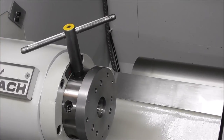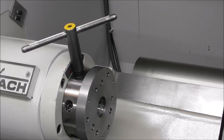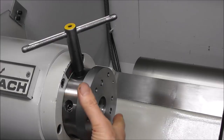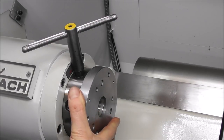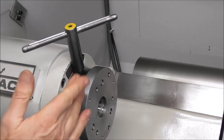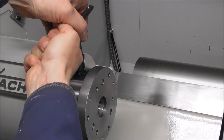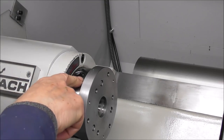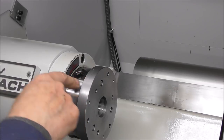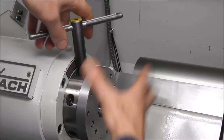Well, that worked out really well. That's actually a really quick way to cut the D14 Camlock scallop. So you machine it in a position that's convenient for machining, but you machine it in closer to the lock face, and that's allowing it now to lock up in the best position between 3 o'clock and 6 o'clock, the little mark should be, and that's working out really well.